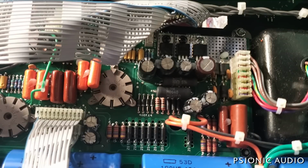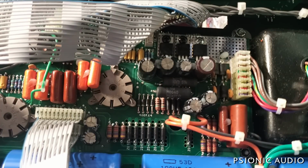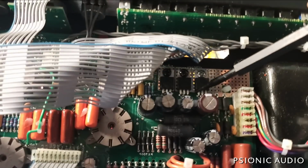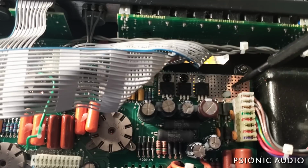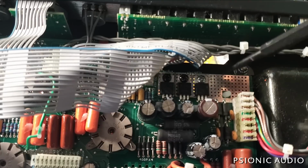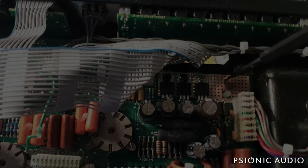2.2K is very, very low filtering for a tube heater DC supply. I would expect more along the lines of 10K than 2K. It could also be a little bit of additional regulation, a little bit more filtering on the actual regulated part. But given that I have access to the incoming 20-something volts here and the outgoing 12 volts here, and I've got this big, nice ground plane here, I'm going to find some suitable caps, like 10,000 microfarad, 35 volts, 1,000 microfarad, and just touch them to here and here and see if that noise changes.